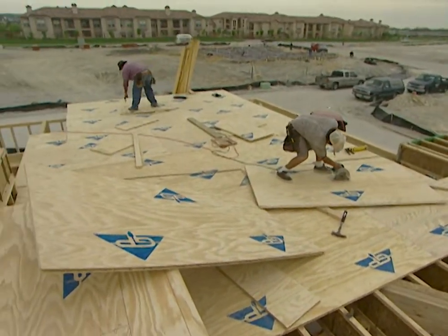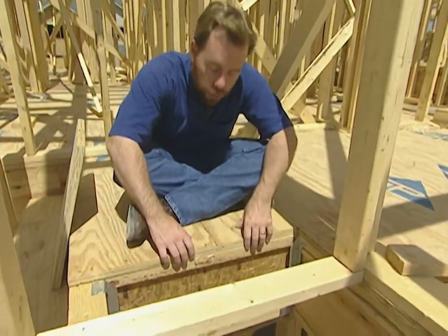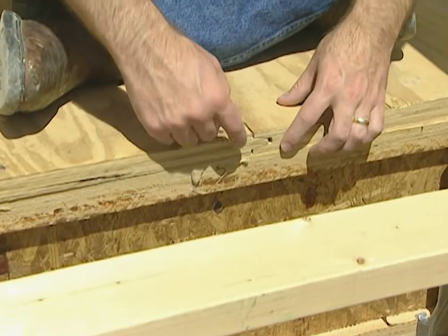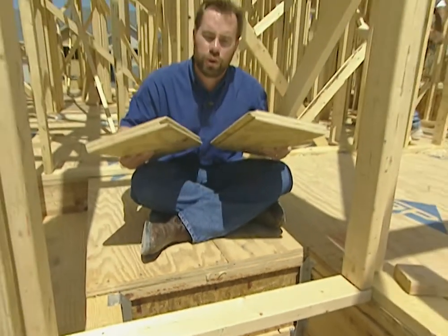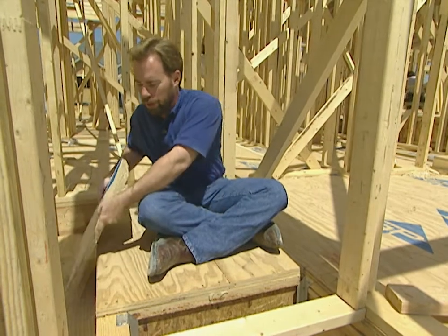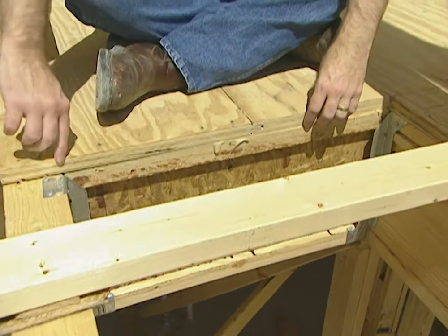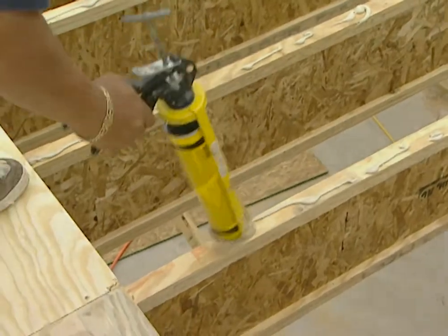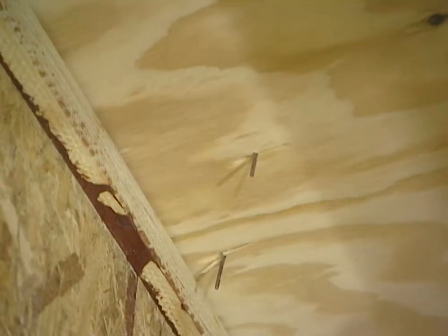This is a million-dollar house they're building here, so they've got a really nice flooring system, and they did a cutaway for us so we could see how the floor decking comes together. It's not just plywood nailed on top of the I-joists — it's actually tongue and groove. You can see the tongue right here, and it slides into the groove of the other piece. One 4x8 sheet slides right into the other. They also put glue all the way across the top of the I-joist. Put the glue all the way across, lay your decking on top, slide it together, then nail or screw it in place — and you've got to hit the I-joist, or it doesn't work.